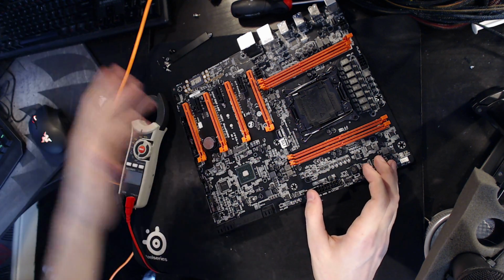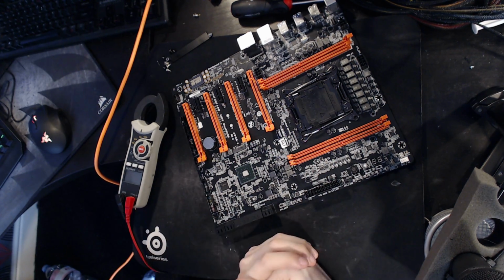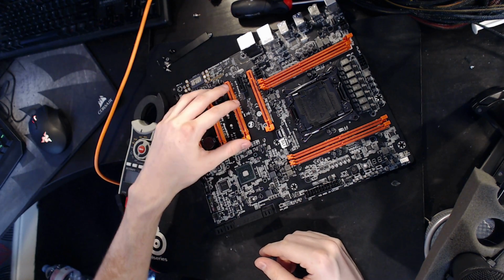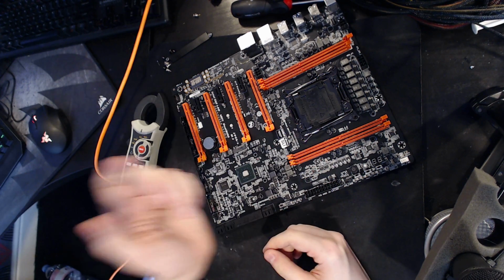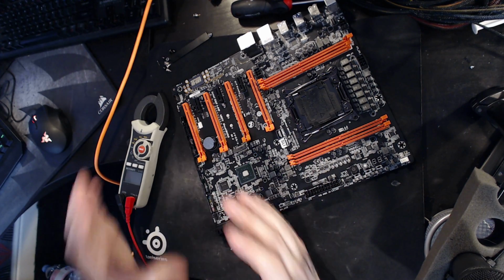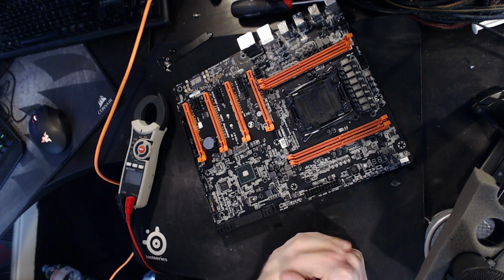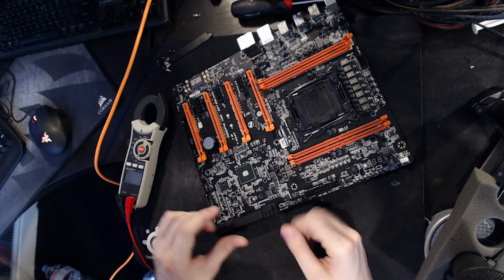However, very quickly everybody managed to figure out what Asus was doing with their OC socket, and everybody copied it. So on what I like to call the second wave X99 boards, like the SOC Champion or the UD4P from Gigabyte, you get an OC socket. The MSI X99A series motherboards, not the X99S, also have the OC socket. I'm not sure about how ASRock implemented the OC socket, but they definitely have it as well.